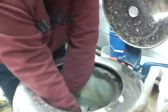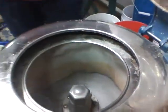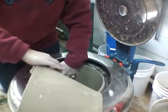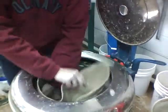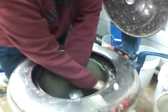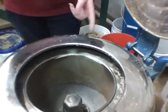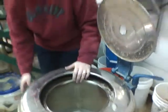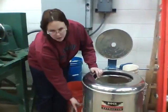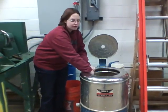We're going to tuck it in so it's nice and flat. Then the next one we're going to put in is a lot thicker — put that in also nice and flat. Once we have that in and tucked into place, you'll take your bucket of chips and liquor and dump it in here. On this side is the drain, so put a bucket underneath here just to catch the water so we can dispose of it in the drain properly. What will be left in here is your centrifuged chips.